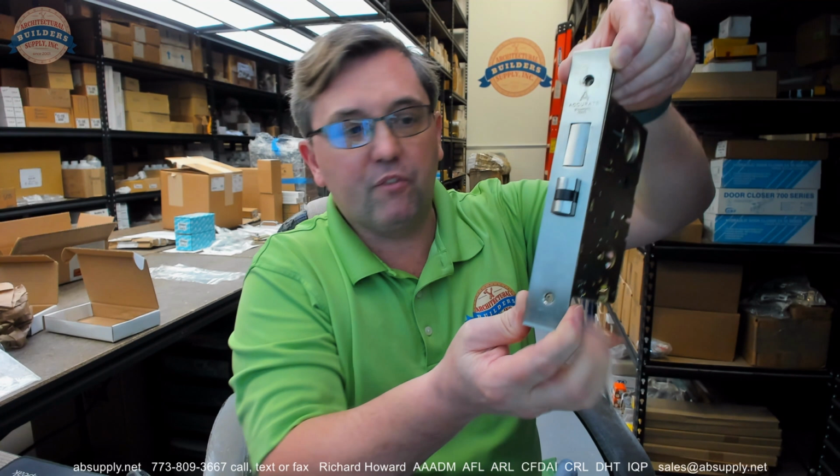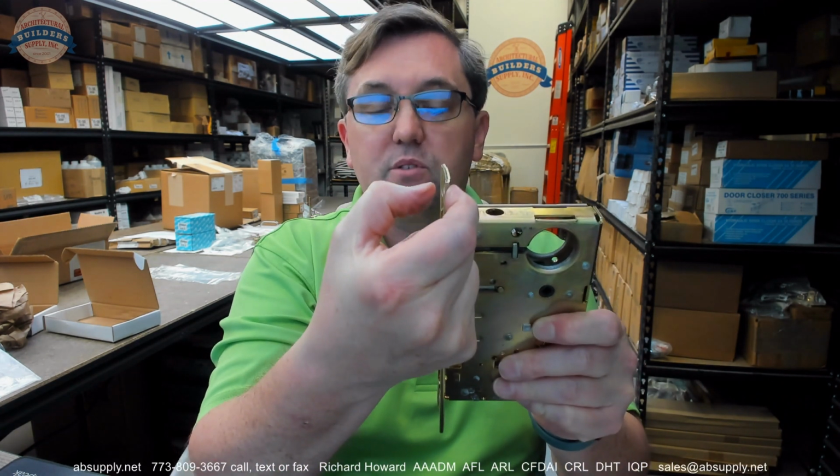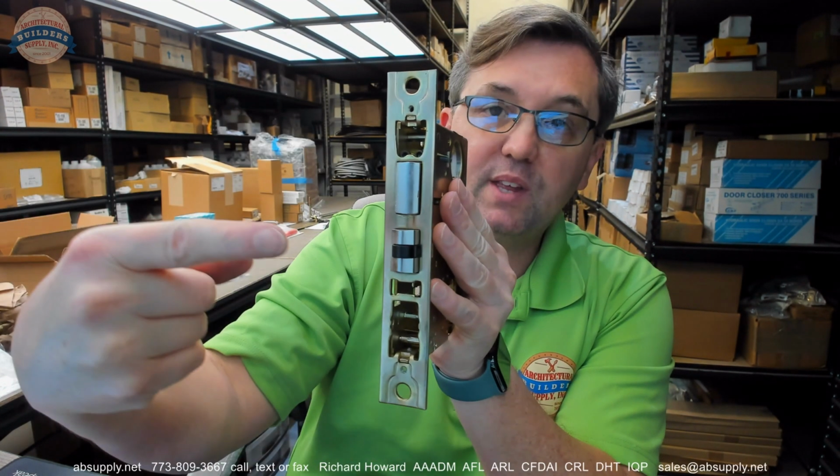appearance of an armor front, but you may have, if you deal in door locks and you have for a while, you've probably seen mortise locks that have just a thick plate outside of here. Well, here's the thing. The armor front covers this raw unfinished edge. Those 2 other screws will mount the lock body to the edge of the door.